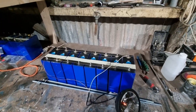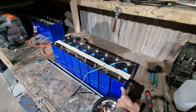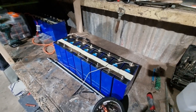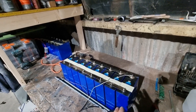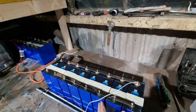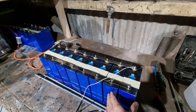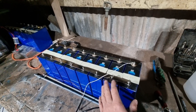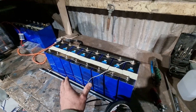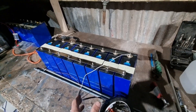This is the battery in question. These are 280 amp hour EVE LFP cells — they're very common and I've got 24 of these cells. I'm building three 24 volt batteries, so there'll be three banks of eight cells to create one 24 volt battery and I'm going to connect those in parallel. I'm doing that because if one cell goes down, it only takes out one battery. I can remove the battery, replace the cell and reinstall it and I'll still have power.